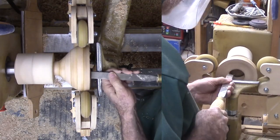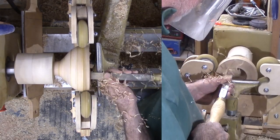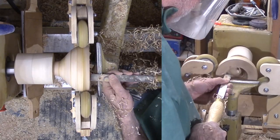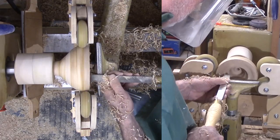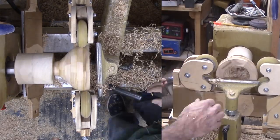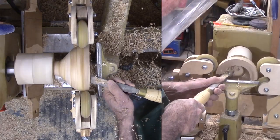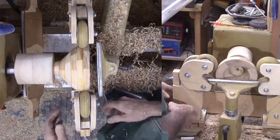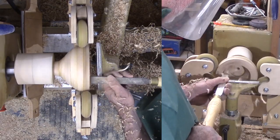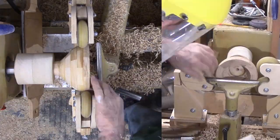The top section is another matter. The topmost segment ring is small diameter. It has had enough time to fully dry, but I still worry about it separating from the faceplate, so I am using my DIY steady rest for lateral support and insurance. The box scraper does a lot of the heavy hollowing. I then switch to a round nose scraper for a more rounded inside curve that no woodturner will ever feel with a finger. I am about at max depth for this tool, but I do finish. Success — no unexpected launch this time.